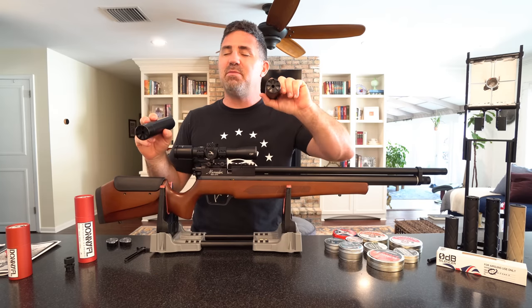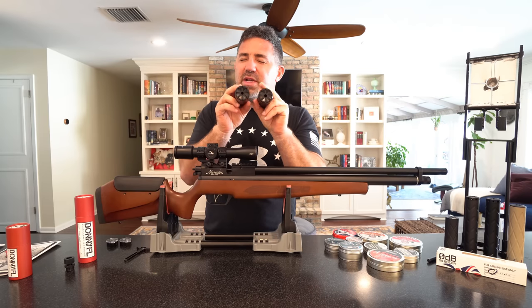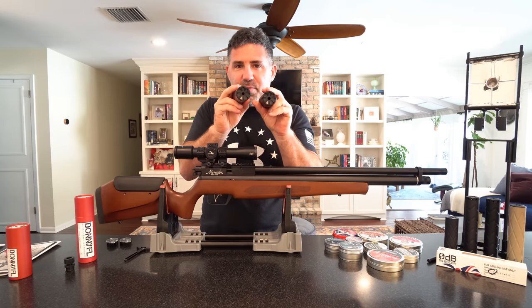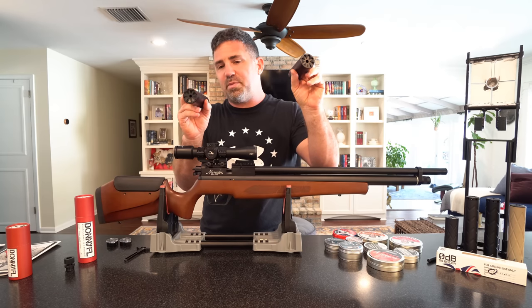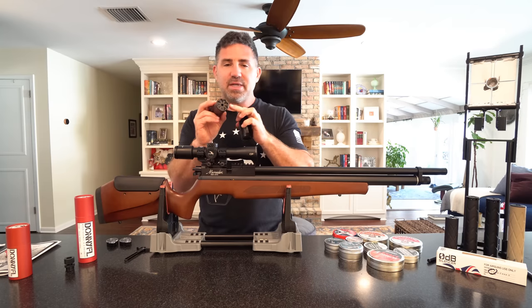But it's a game of diminishing returns. What I mean by that is a 2.5 opening is going to be just barely marginally louder than a 2.2 opening. But a 3.0 opening is going to be quite a bit louder than a 1.77 or 2.2 opening. So the game is to always try to run it as tight as you can without getting clipping.